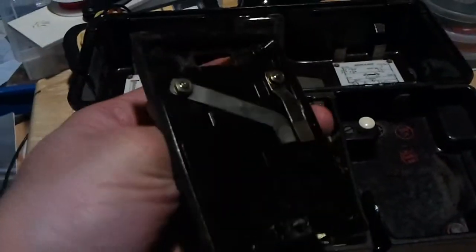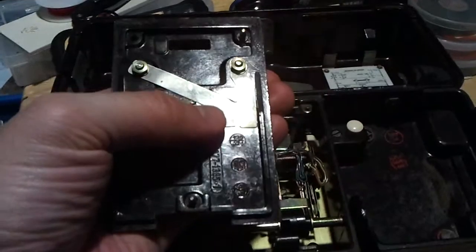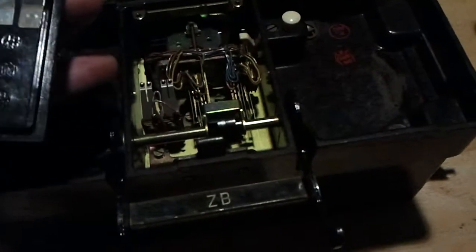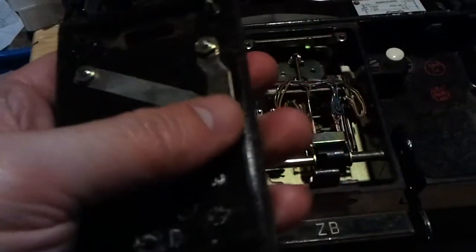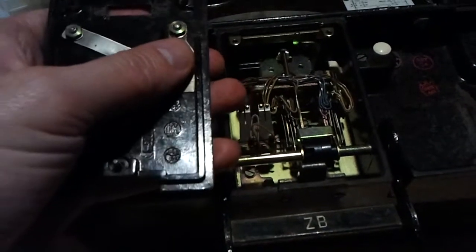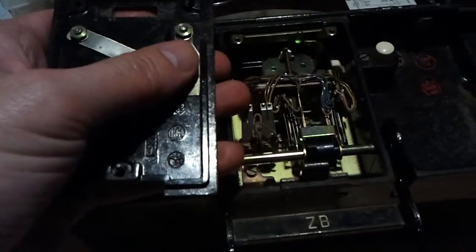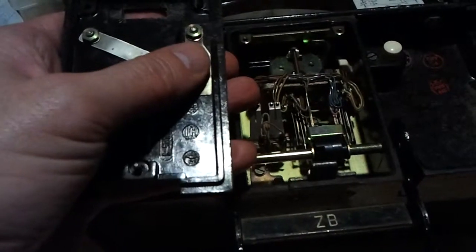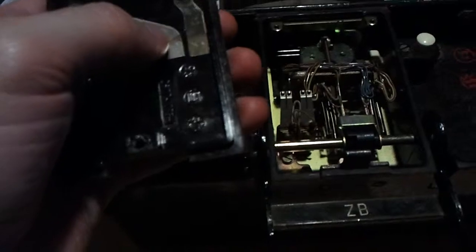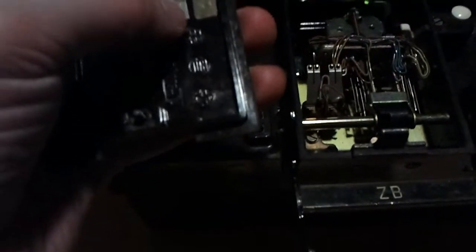So, the underside has 2 plates that complete the contacts, and they simply come in and brush against these spring-loaded contacts here. What I usually do is polish this area with steel wool. Lightly polish the tops of these with fine sandpaper, like 600 grit or better, and then put on these plates a dab of Noalox or OxGuard or any of the antioxidants for electronics work.